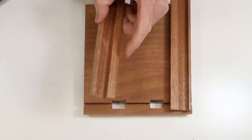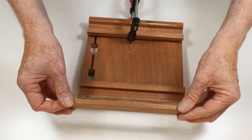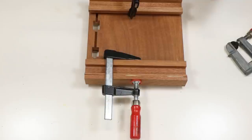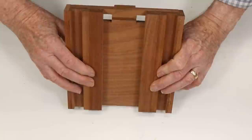Once the glue was set, I glued two thin strips onto the sides. This is largely cosmetic. It just makes the two major parts of the camera have the same surface appearance from the side. The rack gears are held by two strips shaped to slide under the T-track channels that we just glued in place. They will be part of a simple frame that holds everything in alignment. But first, we need to anchor the racks in their place.